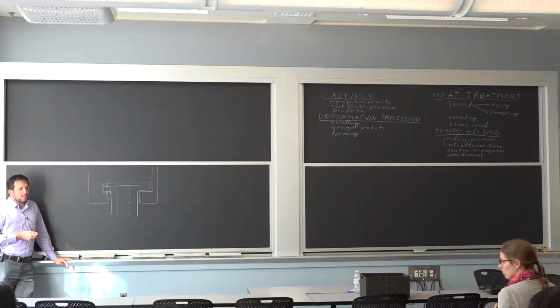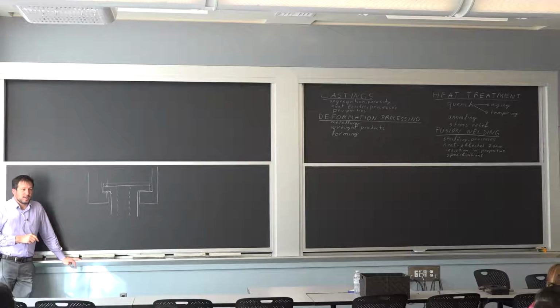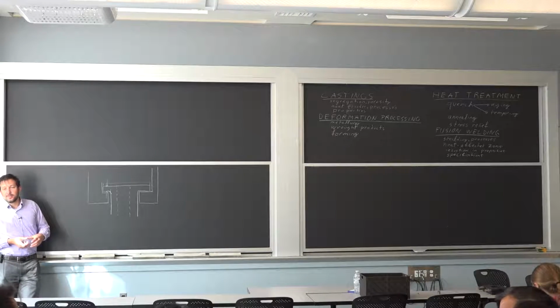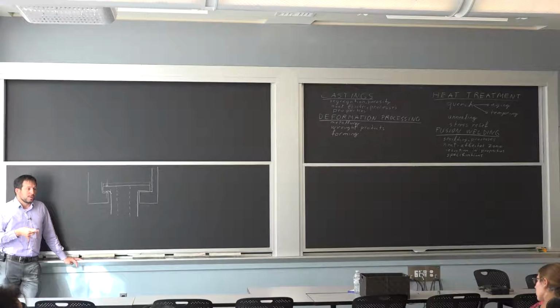But if you wanted to go to the extra step, because assume that somebody, and I don't know that they say that you can't do that, but if I decide to use this in my home, and it falls this way, it's not just creating a big puddle on the inside of the house, it's creating flooding. So there's a good reason why you would want the input that's always under pressure to be a very resistant design. So there's nothing to say that you would not want to have a metal fitting to thread into this housing, just to make sure that regardless of the detail of the load or how long it's used, it's not going to fail at that critical connection location.